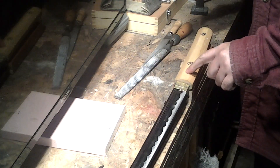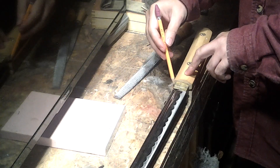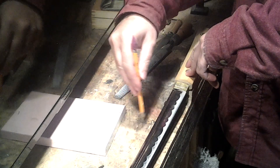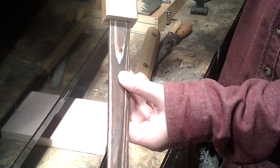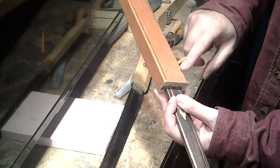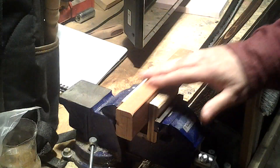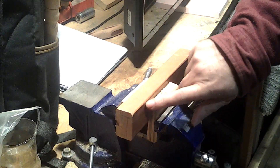So I'll clean up this mess and start working on the handle. I've got the template katana laying on top of the katana I'm making, with the blade inserted into the handle, and I'm just going to trace around this radius of the handle so that it meets the radius of the blade. There are now lines on here that form this radius. I'll just use a file and follow it all down to the line, and then we'll start shaping the handle.